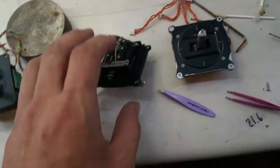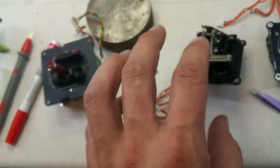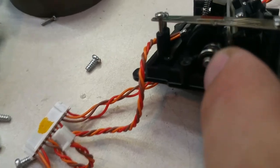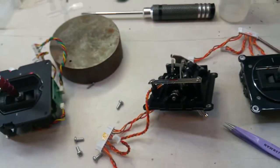That told me it was in the gimbals and not the radio and not a setting. So I took the wires, swapped them with the sensors, and it stayed with the gimbal. What I did was unscrew that screw, pull the magnet off, flip it, put it back on, and now everything's right.